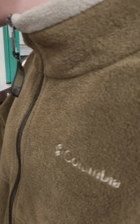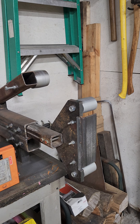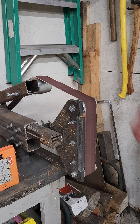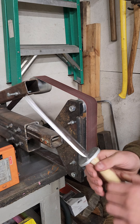Okay, that was the 240 grit. Now I reckon we're going to move on to the 400 — I didn't think of anything that's in between. The 400 grit is really just buffing it up, making it look shinier, and really putting that final edge on. But if you've been around the channel long enough, putting the final edge on is with the 1x30 and the really worn-down 400 grit belt, which provides like the sharpest edges known to man for some odd reason.